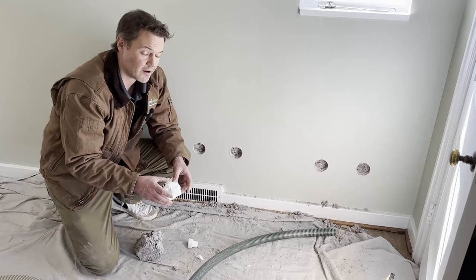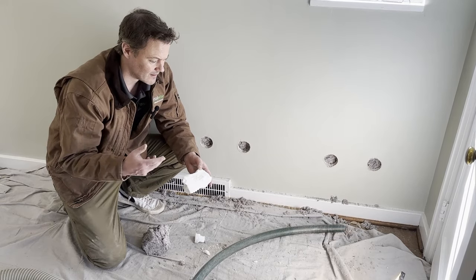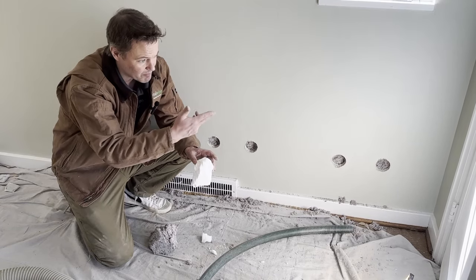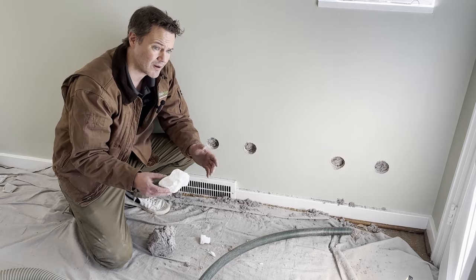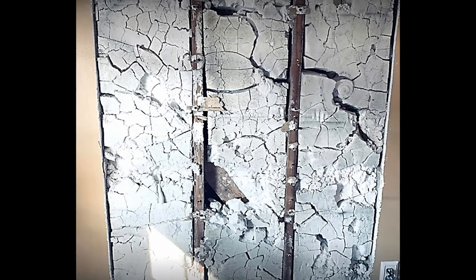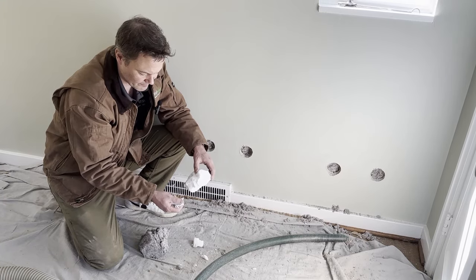This here is the other common type of insulation used. This is what you call tri-polymer foam or water-based foam — some people call it shaving cream foam. What it is absolutely not is spray foam. This is not the polyurethane stuff that you see sprayed on TV shows that looks and performs great. This stuff goes in wet and is water-based. It has a tendency to shrink after it's installed into the stud bays, because as it cures, the water in it evaporates and the foam shrinks. That can develop convection currents on the inside of your walls, reducing the overall R-value and performance. The stuff is just kind of brittle and powdery and breaks apart.